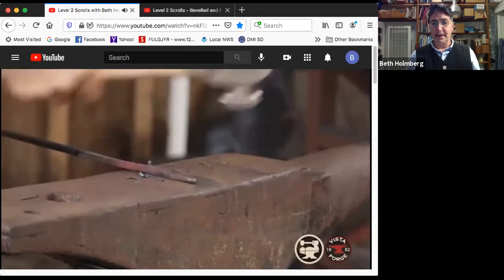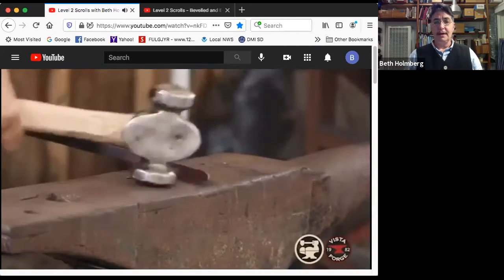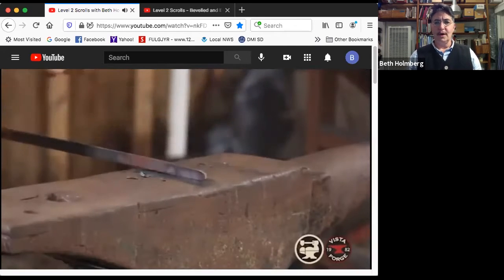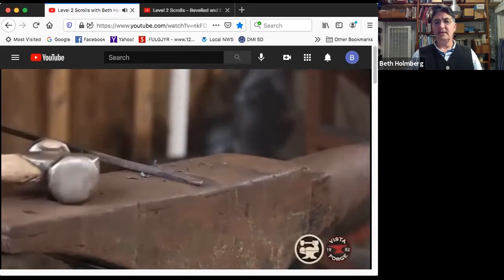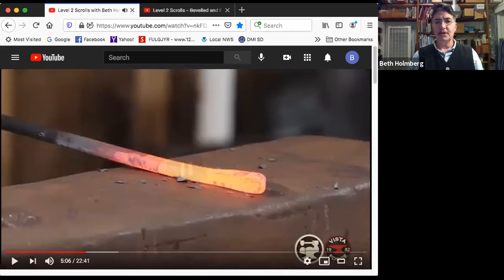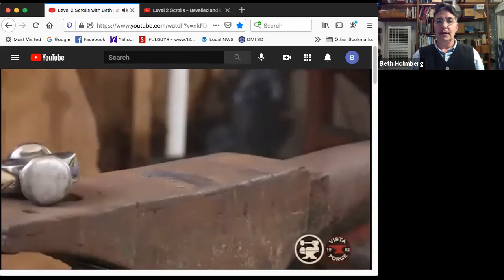I'm bringing the sides in, making sure it looks nice. Getting rid of any bulges or whatnot in that last dying heat. This sort of planishes the material, leaves it nice and clean. So that looks pretty good. Reminder, you want to preform it, bring in the width, so you've got a bulge upwards on the end in the thickness before you start working on that taper. That's going to keep this from having any problems.